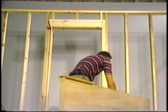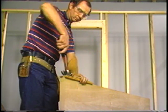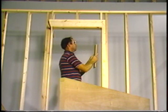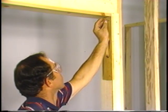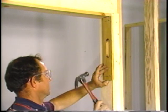Now that the shallow route is completed on all three door mortises, our carpenter will make the same routes to the jamb. This is to avoid having to reset the bit depth after each mortise. By sliding the entire template tight against the head jamb, the spacer tab will automatically provide you with the same dimension as used on the door when the template was hung by the spacer tab.